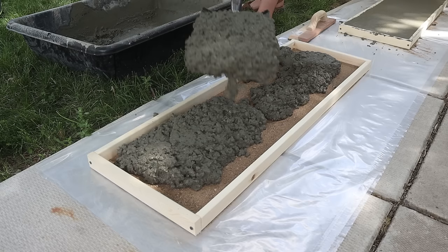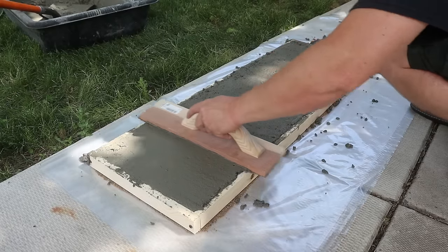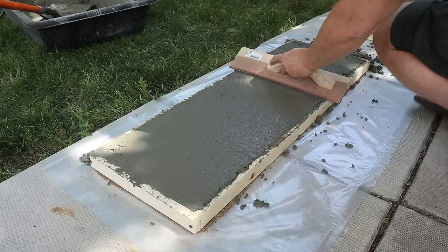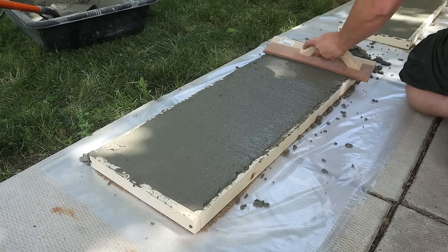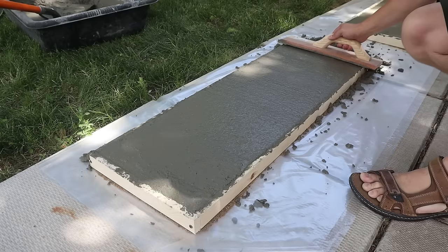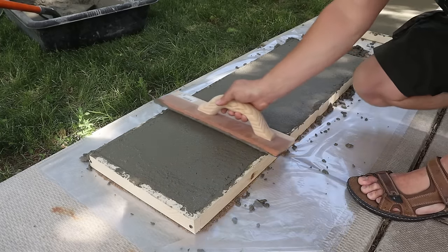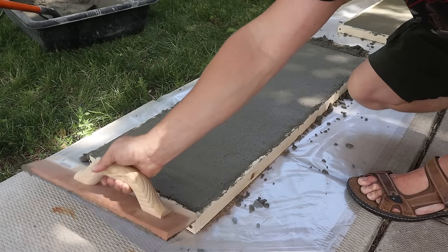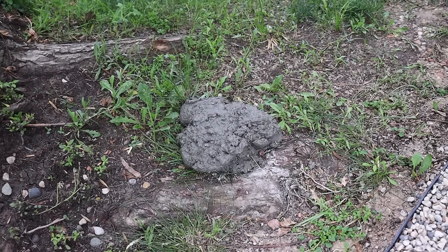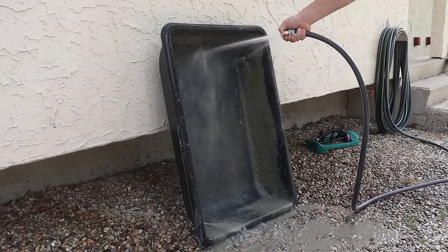For a larger stone, grab a long straight 2x4 bigger than your mold and work across it in a saw-like motion once it's filled. Any concrete that accumulates on the leading edge, push it right over the edge. If you've got a low spot, grab some of that concrete, throw it in, and work back over it in a saw-like motion until everything's smooth. Wait about a half hour before using the edging tool. Dispose of leftover concrete and ball it up until dry, then throw it out. Now's a great time to clean your tools.